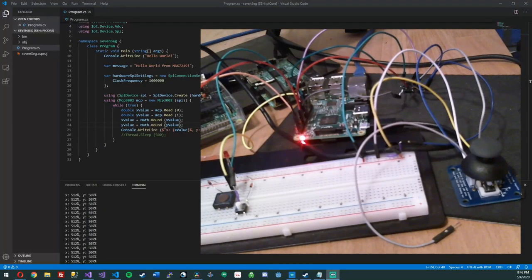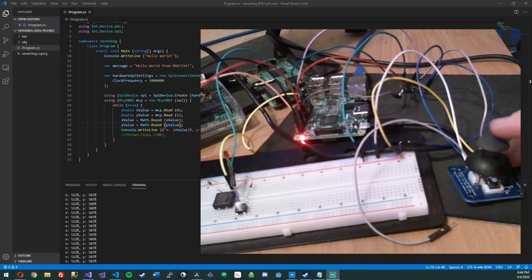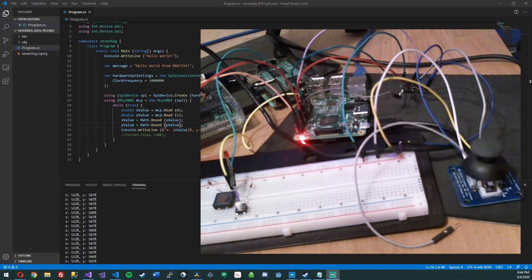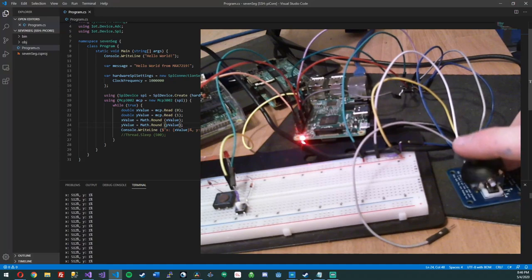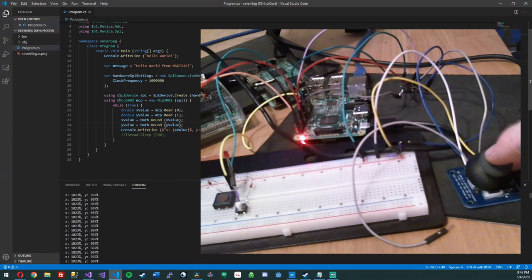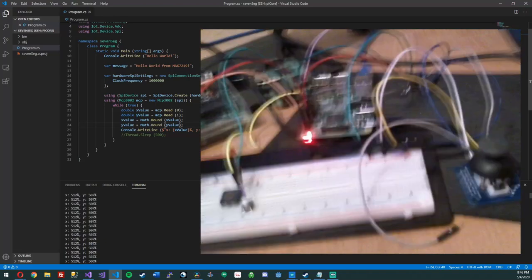As you can see here, I got the MCP3002 hooked up to the Raspberry Pi, and I'm just testing the analog sticks. If you see right there in the left-hand corner, I'm getting the values. These are in the hundreds. I need to divide that by 100, so it's about 50% when it's just in the idle. And this takes effect later on with my Kerbal code.